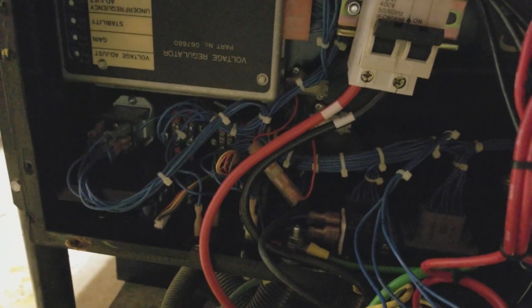I just pulled this out and ordered it from Grainger — it was under $20 on Grainger, under $25 on Amazon. It's a Schneider Electric part for this relay. You can get your part number right off the top of your relay. The relay came in today and I took the wires off and put them back on exactly like they came off, stuck it back in, pushed the start button, and the generator works fine again.